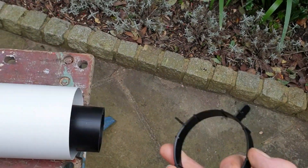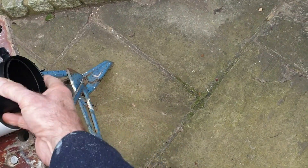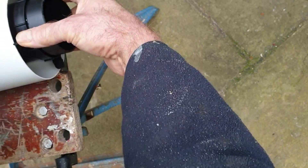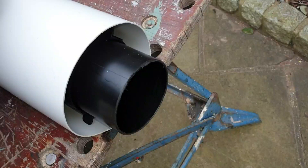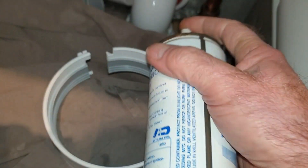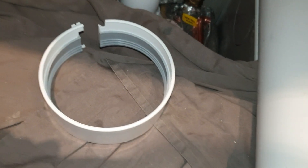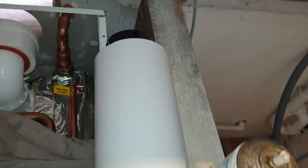Once you've chamfered your end, you've got the stabilising piece that goes over there — it just centralises your pipe. Now I'm going to put the sleeve back on, but first I'm going to silicon it up. Spray the silicon round on the seal and put the clip back over, then try and slide the pipe in.